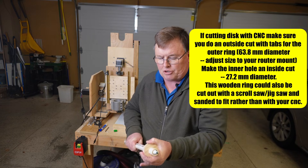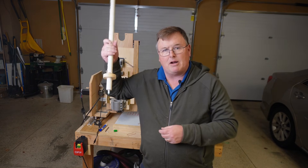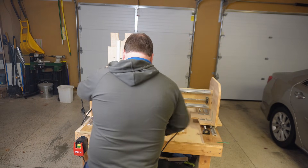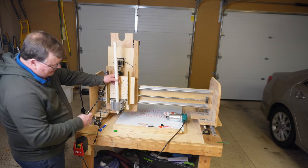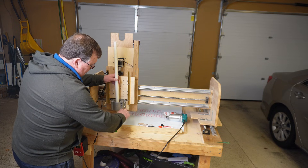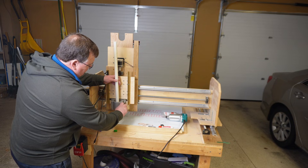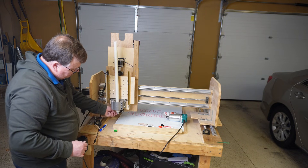If you made it too loose, you can put some hot glue on there after the fact, or super glue to make it permanent. I prefer to make it removable. That essentially is what you need. Go ahead and set it down into your router mount, then adjust the height so that you're far enough down to press on your whiteboard surface. Tighten it down just like you would your router inside your CNC — tighten both top and bottom. If you push up, you can see it's got the give.